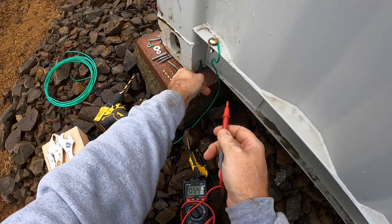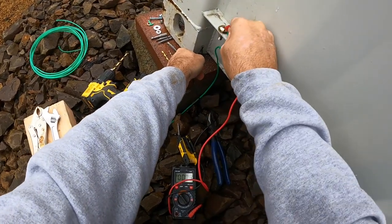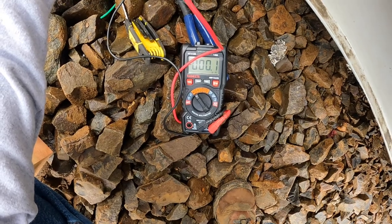Hopefully that should work good. I'm going to go get an ohm meter or volt meter and see if we can check the resistance between the container and the rod to make sure we don't have any high resistance there. What I'd expect to see is pretty much zero — it might be like 0.01 or 0.001 — but we should see pretty much zero resistance between some spot on the container and the wire attached to that bolt. That will tell us if the bolt isn't connected solidly to the container or if the wire isn't connecting directly, so we'll double-check that. If those look good, then I think we're set.